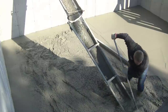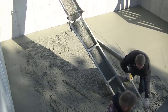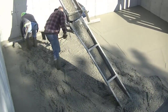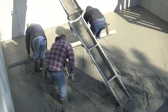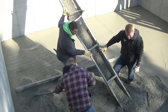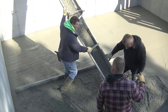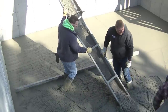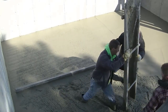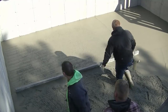I'm going to change the angle of the camera in a second, so let's get this other part screeded first. We're right at the end right now, trying to decide how much concrete we need in here and not have too much — but we also don't want to run short. If we get way too much in, we've got to shovel it out. If we don't have enough, we'll have to either bucket it around from the outside or dump some on the ground out there and shovel it around. We're trying to get just as much as we need, but not too much. So we'll get rid of the chute, pass it to the driver, and he's going to wash that up for us.